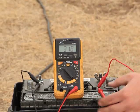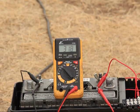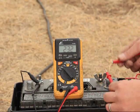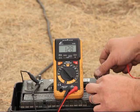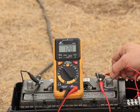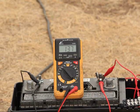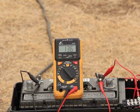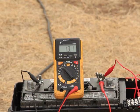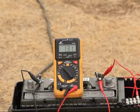Although it totally works, what I don't show here is what happens when I move that over to amps — and I apologize, I looked at my video and realized I didn't capture that. If I move that over to amps and put that clip on there, it just stalls it out like a brake. When the winds are really kicking, it'll maintain about 1.5 amps, but there's just way too much resistance with the motor at that point.